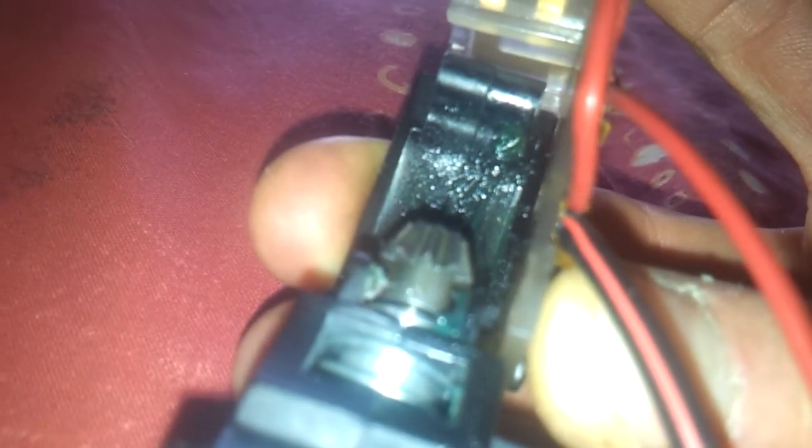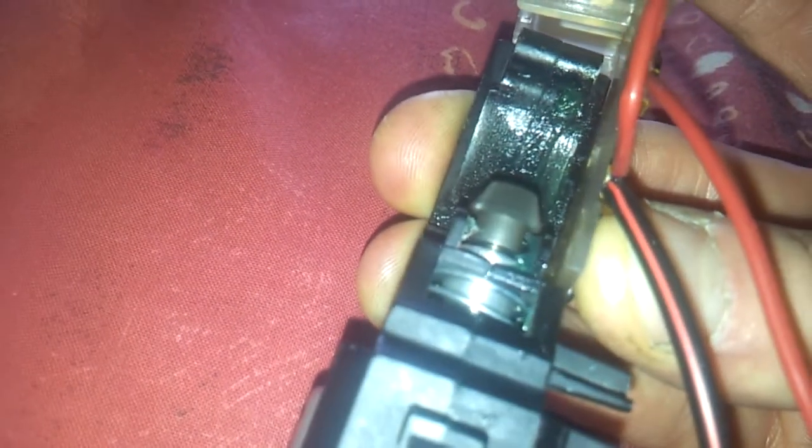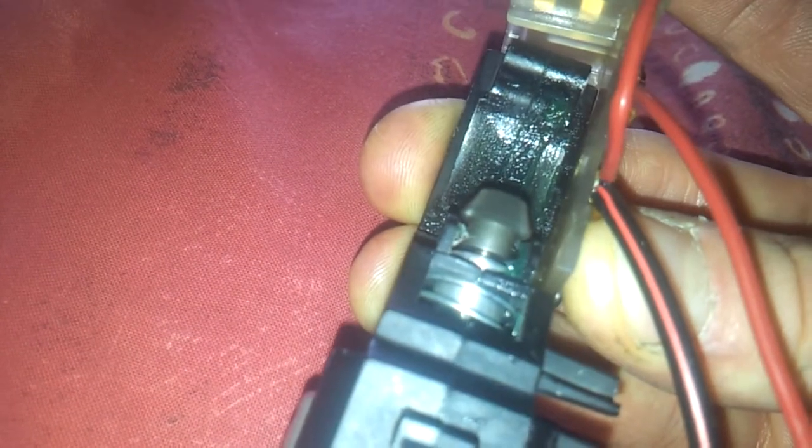The active braking will also brake the engine, which is not done on the original setup. I'll show you how that looks. As you can see, there's a pinion wheel. I'm going to pull the trigger contacts together and you're going to see it spool up. Now when I let go, it has to run - it slowly comes to a stop. And release. So as you can see, it takes about maybe a second to actually stop the pinion wheel from moving completely.